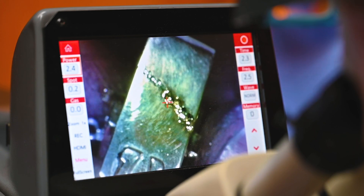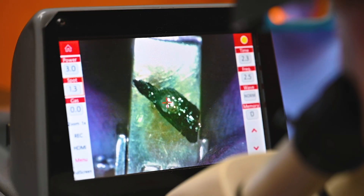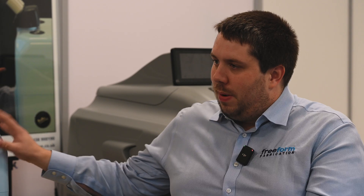For silver, there's a tip: black it out. The laser is essentially hot light, so it likes dark things. Use a Sharpie over the area where you're going to be working — just black it out. There's no contamination; it burns off when you laser it. The Dado 1 is 50% less powerful than the Dado 2, so the Dado 2 makes working with silver a lot easier. The Dado 1 will still work on silver with blacking out, just not as effectively as higher power machines.